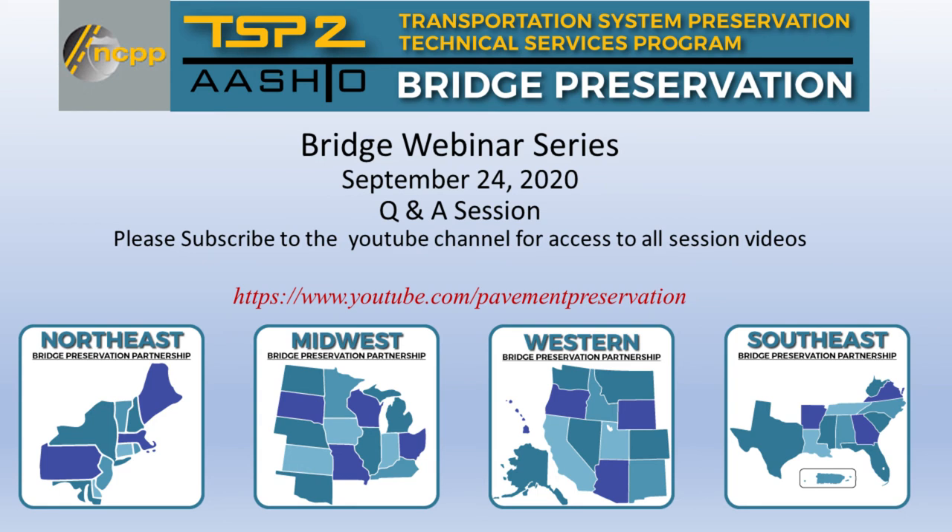Is it important to engage the top mat of steel with a concrete overlay? No, you don't necessarily have to engage that, especially as long as you're getting good surface prep and you don't have any microfracturing or delaminations in there. You want to get that good roughness aspect of the substrate for the overlay to grab to. You can do that without having to grab onto the mat.